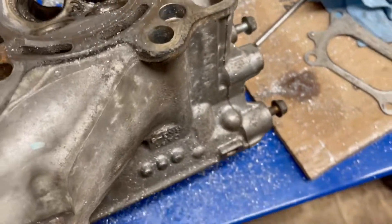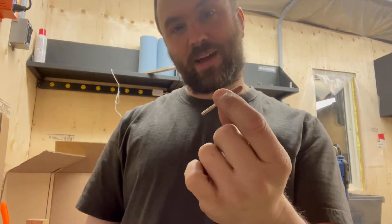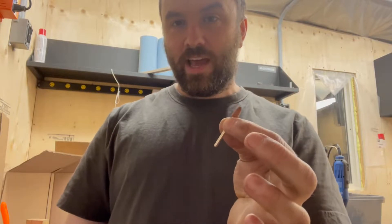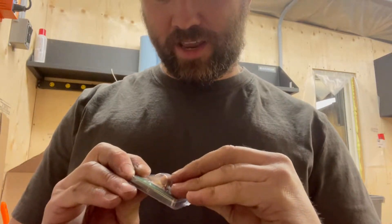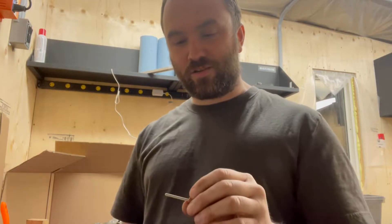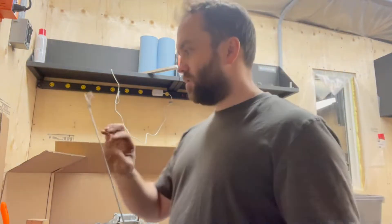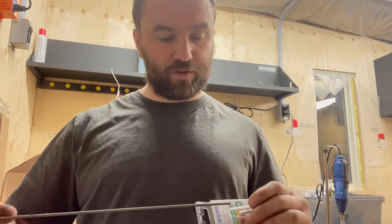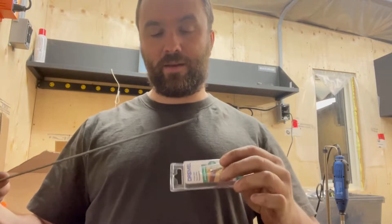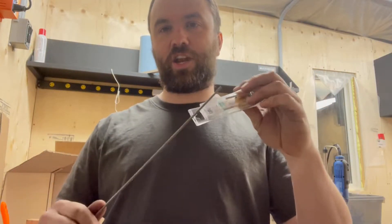These are the old bits - you can see how long they are. I bought these about three or four years ago when I did my last head. These are the new ones - see the difference in shaft length? They've taken off almost half an inch. They charge nine bucks a piece at the store; I got them on Amazon for seven dollars. So I bought this rod, cut it about an inch and a half or two inches, welded it on, and I'll bend it back and forth when it's in the bit to check wobble - because we spin these up to about 20,000 RPM and with vibration they start shaking, come loose, and can break off.